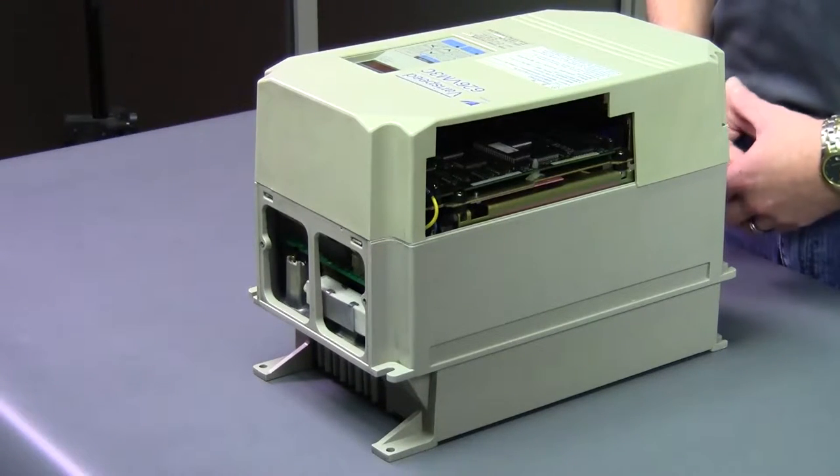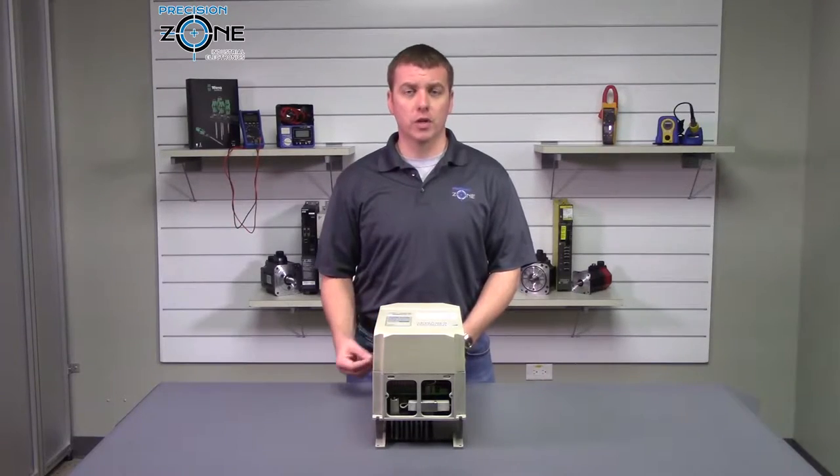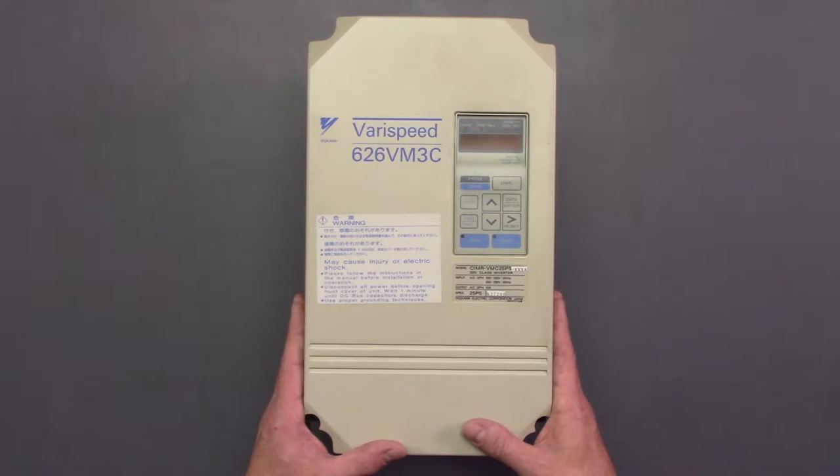FD17 is a magnetic sensor wiring alarm. You'll want to check the connections and the wires for good continuity. Most of these problems can also be caused by a faulty control board in the drive, so please keep that in mind.